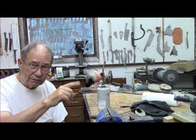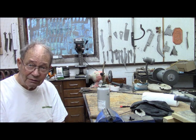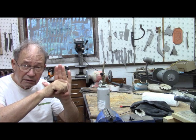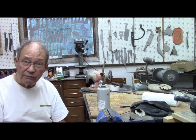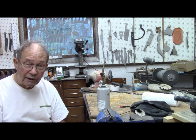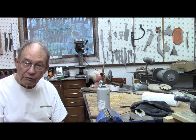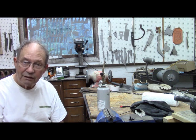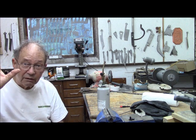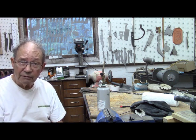After the torch, the top jaw was a little bit loose, which meant I had tension held by rust only against the lower jaw. I clamped it in the vise, put a lot of downward pressure on it with the screwdriver — couldn't do it. Put a nail through the hole as well as a tougher piece of steel and tried to twist it — still couldn't do it. I was applying so much pressure I was in danger of actually breaking the hammer itself, because the little hammer stem is only a little more than a quarter inch thick. Didn't want to do that, and didn't want to buy a complete hammer assembly for a gun I was going to sell.